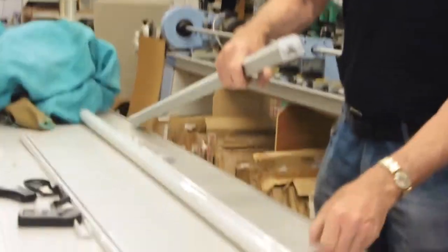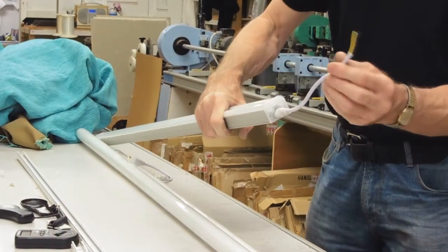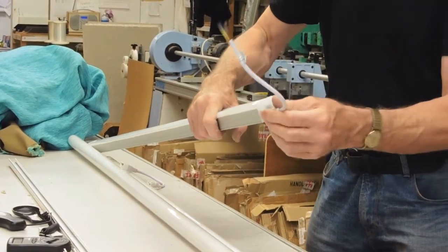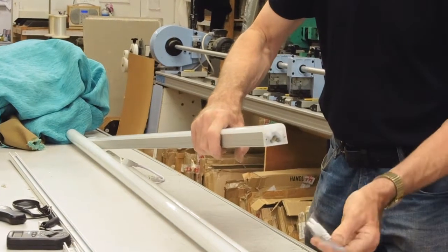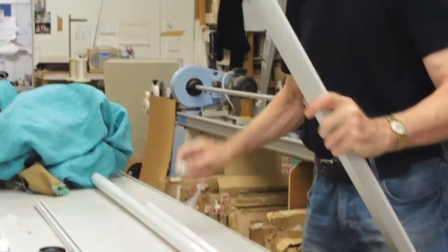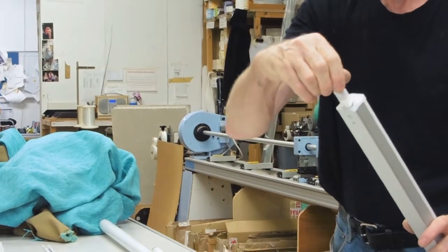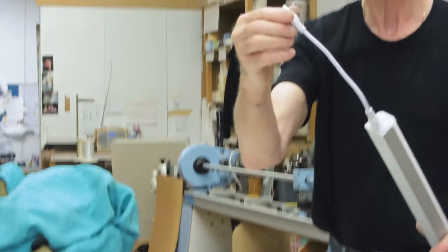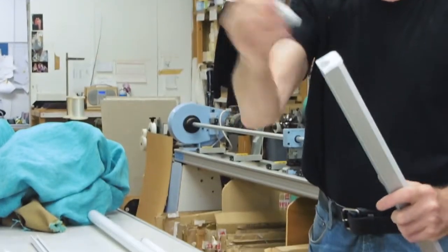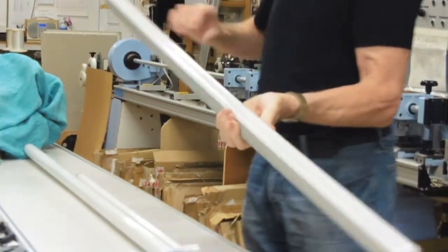Looking at the connection side of it, this is how you connect it to the mains — plug it in. This end would go into a junction box or some other form of connector. We can do these cables up to 1.5 meters long. If you've got a string of them, you can connect them together like so — again up to 1.5 meters — and we can do an extended cable if you need it. Up to four or five units totalling 200 watts can be clipped together.